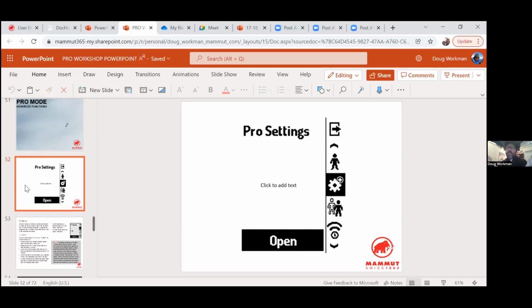And what we're not going to do is give you audio sound relevant to two different targets. That sound is going to be relative to one target. So it's going to be impossible from a sound perspective to identify overlap. And you're not going to see an indication of overlap on the screen. So any digital only beacon is really not going to give you much of a clue to that overlap. So having access to listening to the analog tones is going to be the most surefire way to identify that.